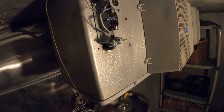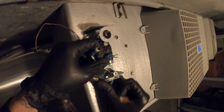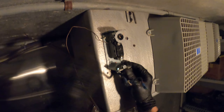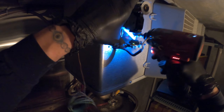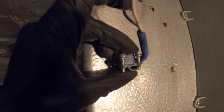There's a little connector here and that's what's holding the wiring in place. Let's see if we can pull the wires out. We do have this connector that I would like to reuse. Here are our wires and this control is pretty much free — there are just two screws holding it. The old control had one of these connectors but there's not one coming out of here, so we're going to install one in here and one in the new control.